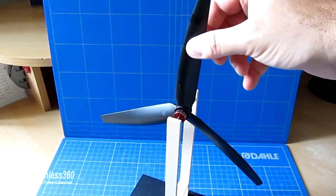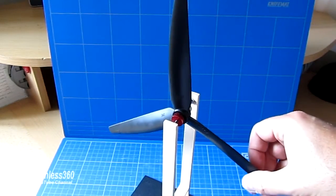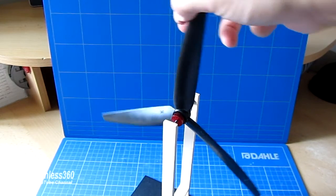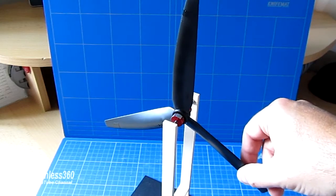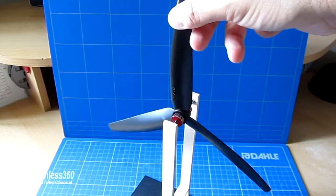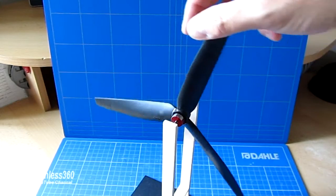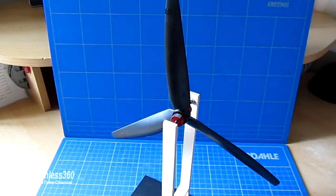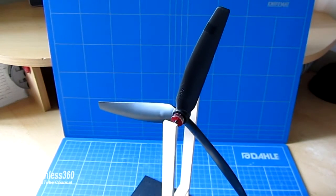Now on that number one blade we've put a final bit of tape. To prove that it's balanced, a way to check it is to put each blade vertically in turn and just make sure that the blade will stay like that — so that's good. Interestingly, that blade is not quite right — that blade is fractionally too heavy, it's pulling it over. So that is blade one that I've just done; let me take a tiny bit of tape off and we'll do one final check.